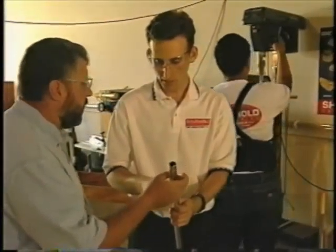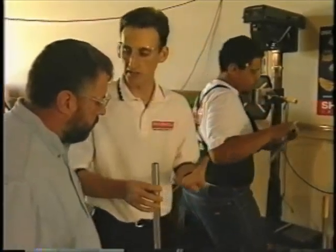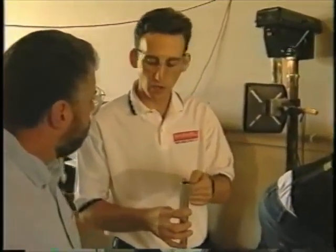Doesn't the handle grip go on one side? A grip does go on one side. Why would you do both sides? What we're concerned about in boating is always safety. If it's rough on the inside and the grip, it can actually cut through the grip and then cut someone's hand. So we make sure we radius both ends so it's always finished.